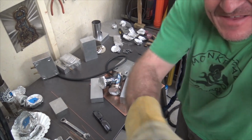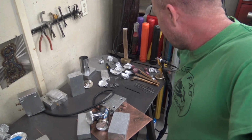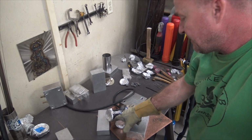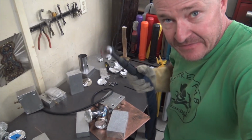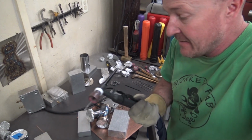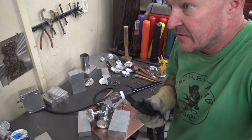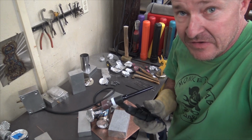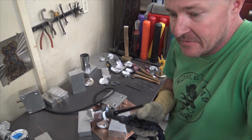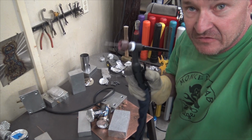So I'm sure you guys, I've probably deleted or cut most of that out or super fast forwarded it, so you guys don't have to suffer through that. But a lot of times I'll get questions. I'm like, well, Mike, how do you get way down into these little joints? And the answer's always the same. I just take my tungsten and stick it out some ridiculous amount like that, and I don't have any trouble. There's no wind in my shop. I turn the CFH to 30. I leave it there. I use a lot of argon. I don't care. That's a minor cost to me to make sure I get my customers good quality products. And yeah, I'll stick it out like that and just hit it.